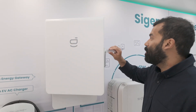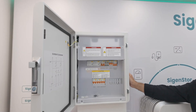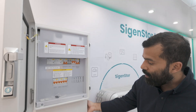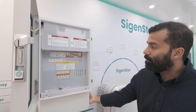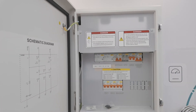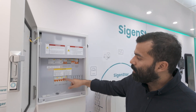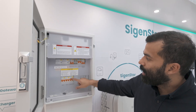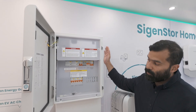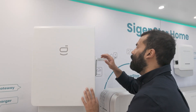Next to it we have our new Gateway Home Pro — in this case we have the three-phase version. We have a decorative cover to cover the cable entry, and we now have a bypass switch. It is a bit smaller as well. Keep in mind we are showing here the 63-amp version for the UK, but we will also have a 100-amp version. You can also use this for partial backup.